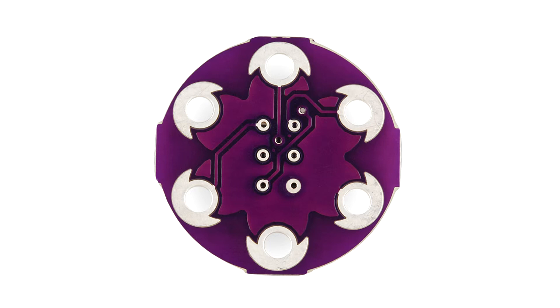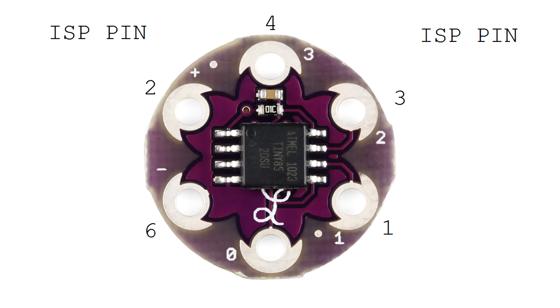So what you need to do is connect your in-circuit programmer with pin 1 going to pin number 1 on your board, pin 2 going to VCC voltage plus, pin 3 going to pin 2 on the board, pin 4 going to pin 3 on your board. Your reset goes to the back of the board — that's on the small red connection. And pin 6 is ground, going to the negative.